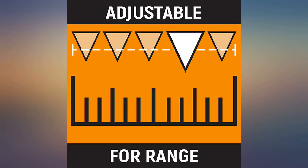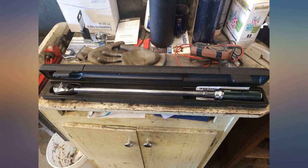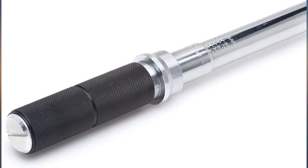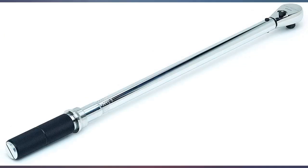Our crews put a lot of pipeline underground fittings together. We do flanged and mechanical joint fittings. Mostly we do 3/4" bolts so the torque is set to 85 ft-lbs. We torque them all — we'll run them up with an impact but every bolt gets a torque wrench on it. They are mostly stainless bolts so they often get checked a couple of times.